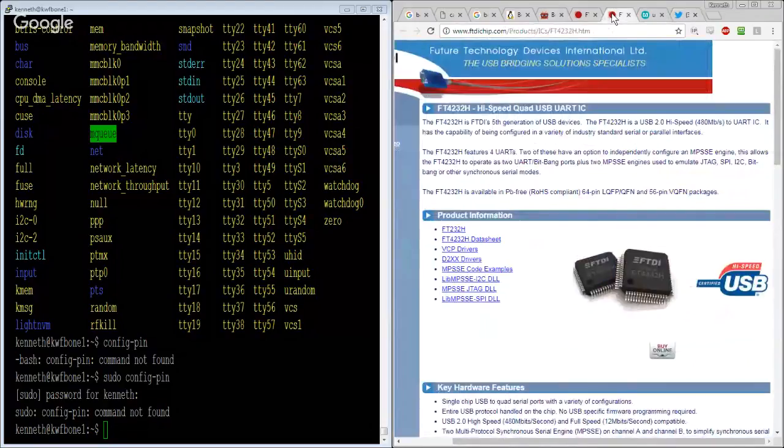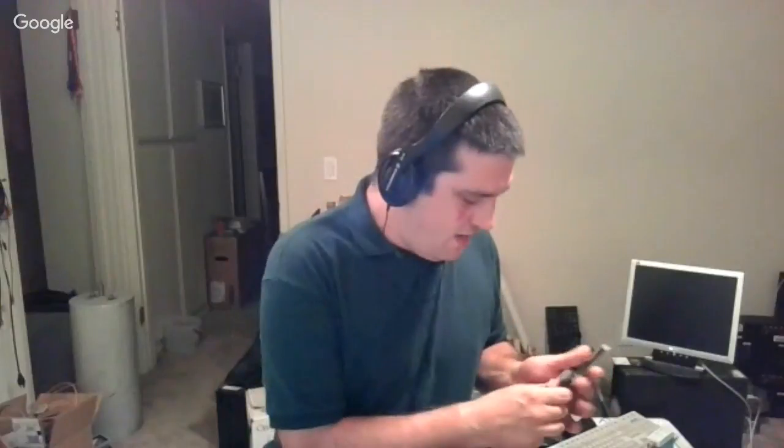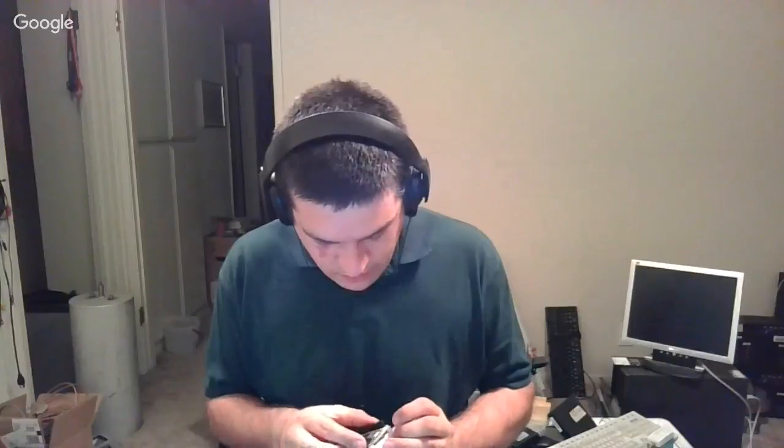Yeah. All right. Well, so I think we just about need to admit defeat here on this one. So I've now spent an hour trying to get this BeagleBone to cooperate, and I can't get the UARTs to come up on it. It might be pretty obvious once I finally get the exact right guide for it, because we're talking about changing one config file somewhere with two lines, or running some command. But the community, they've changed it so many times, and the community is just so uncohesive. I don't even know where to look.